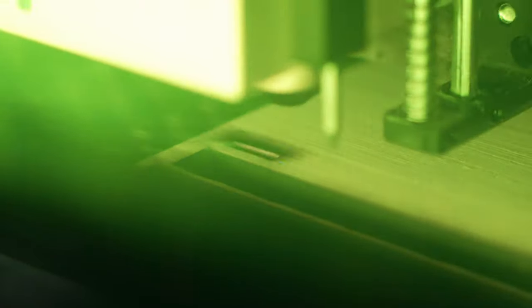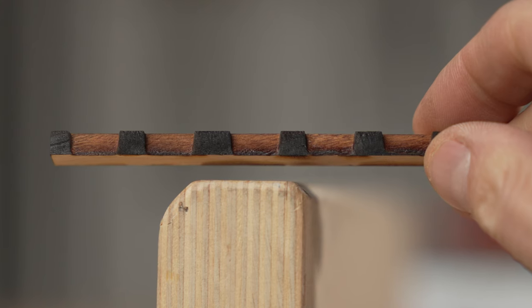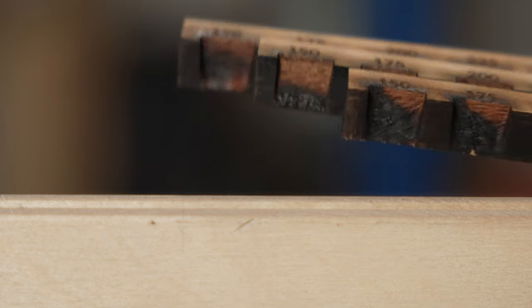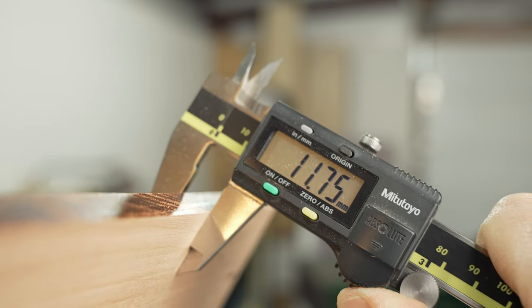I made a new test where I'm actually cutting the angle on the edges of the wood to see if it would work in actual dovetails, and the results are interesting. When I go slow enough to make it all the way through the full 12 millimeter depth, it lights on fire and burns the surrounding wood. I've also made the classic blunder of forgetting that wood is not a man-made material — it's natural with density variations. So with the same speed and power, it came out with different depths every single time: sometimes all the way through, sometimes not. I saw that density variation not just piece to piece in the cherry, but also within the same piece. So half inch? That's not going to work.